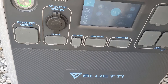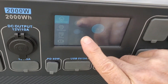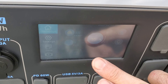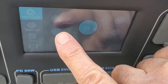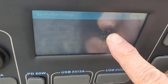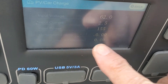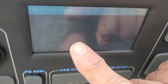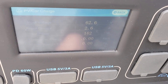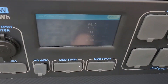There's the green light — so now we are charging. As you can see here, we're pulling in about 156 to 132 watts — it's bouncing around — as far as current coming into the unit from the Sun. If you want to see exactly what's going on, there's a little icon here — touch it. So it shows input voltage at 62 to 64 volts coming in, input current at 2 amps, and input power at 160 watts. So it's collecting electricity at 160 watts input.